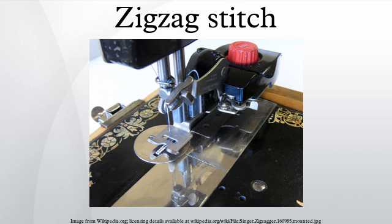Singer zigzaggers. Singer produced a variety of Singer automatic zigzagger attachments over the years, including part numbers 160,985 and 161,102. These zigzaggers are equipped with pop-in cams for making 4 different zigzag stitches, as well as a bite control for choosing the zigzag width.